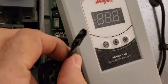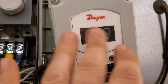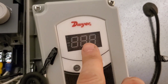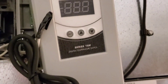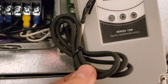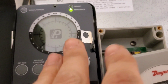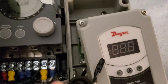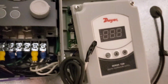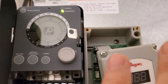We've pulled the neutral wire off this controller because the sensor is not reading correctly — you saw in the beginning of the video the reading was jumping all over the place. Since the sensor isn't working, this controller won't function correctly. Until we get the sensor replaced we're going to rely on the defrost clock and not the defrost termination controller. I would recommend they don't use this chamber until we get this rectified, but we're still going to run it to confirm we can get down to temperature.